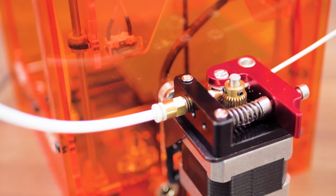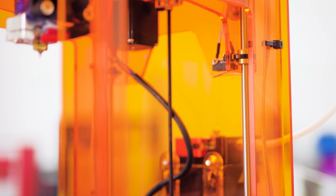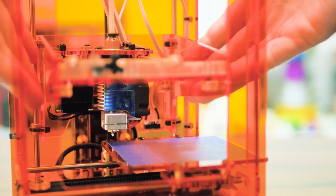Still 4mm thick unsupported linear rails and this tiny M4 Z-axis spindle which has a ton of backlash in the nut, all in combination with the 4mm thin acrylic frame are anything but trust inspiring. But in the end, it works.